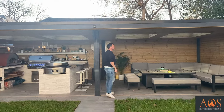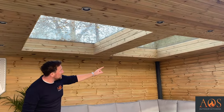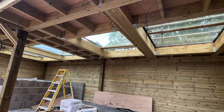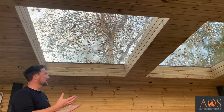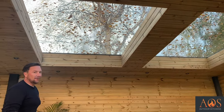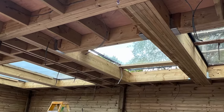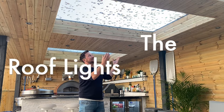When designing this we started with one of our 3D designs. I was going back and forth with David and he decided he really wanted lots of light in here, so we integrated these four ginormous roof lights. These are two meters by about a meter and a half and incredibly heavy. We built the roof and didn't quite realize how heavy they'd be. On the sides of all the roof lights we have these huge timber joists — around five to seven joists bolted together on each side — to take the weight.